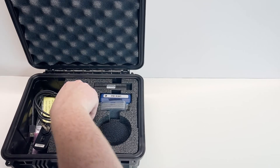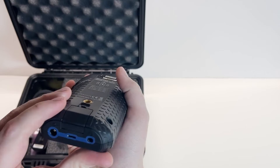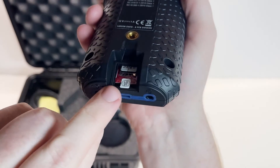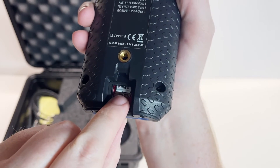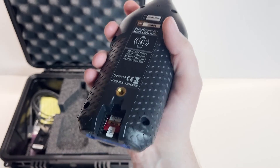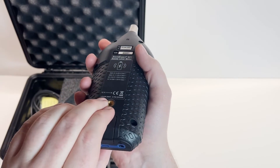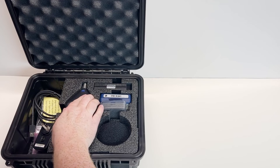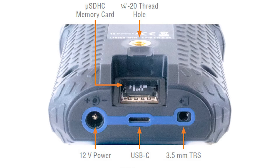Micro SD card slot. The instrument comes equipped with a micro SD card located behind an access door on the bottom of the instrument. The SD card is not typically removed unless for troubleshooting purposes. Data should be downloaded via USB or Bluetooth using G4 or LD Atlas — it is not necessary to remove the SD card from the meter to download data. The micro SD card should never be removed while the instrument is powered on. Also, the access door should not be open while the instrument is powered on, to help reduce the risk of static charge.